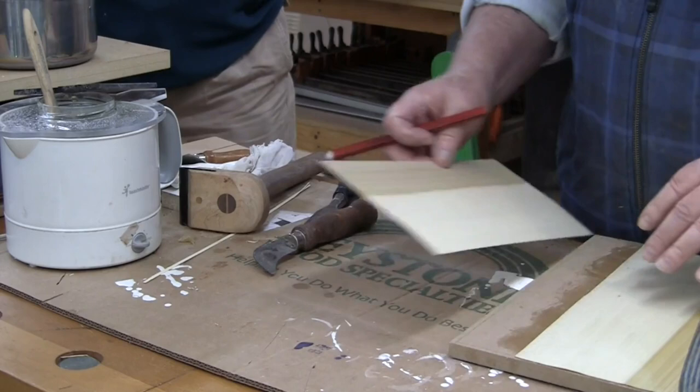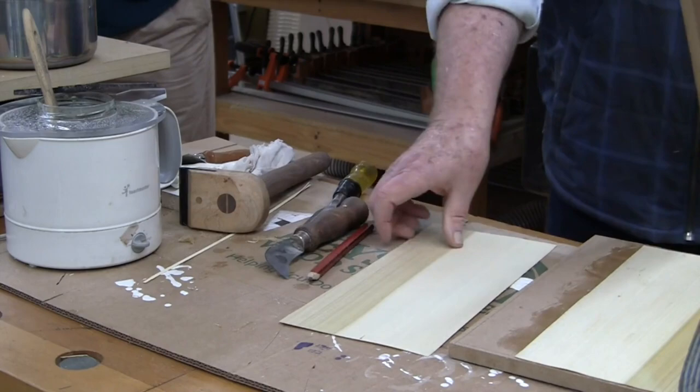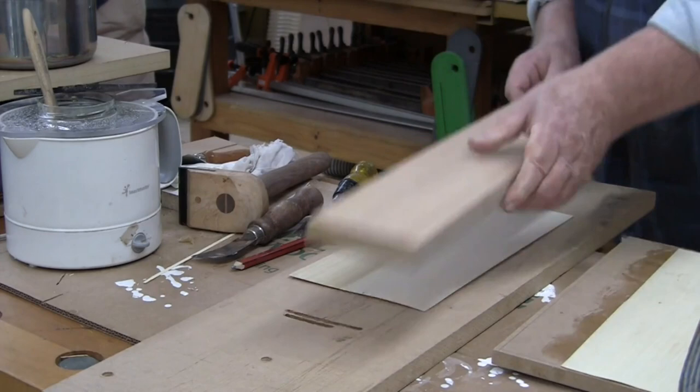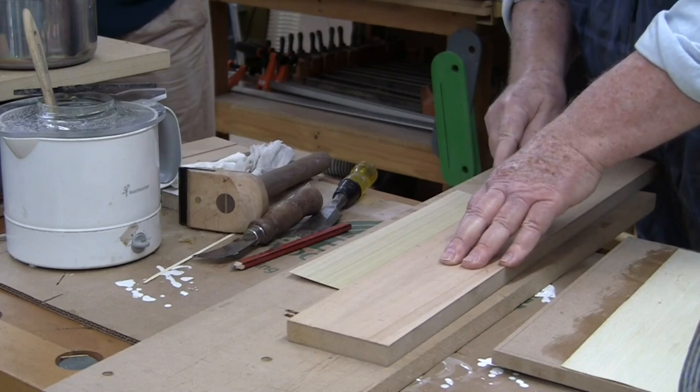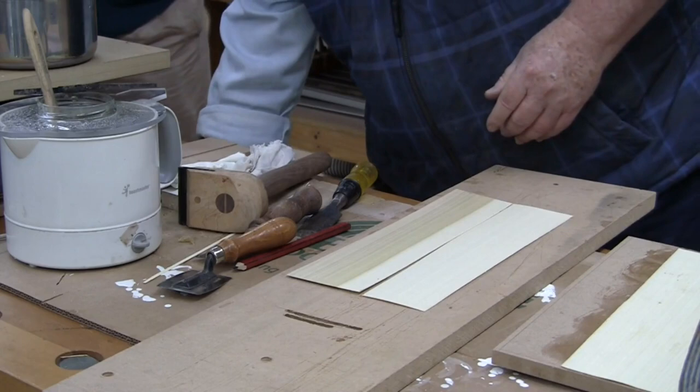How hard are you pushing with a hammer? Really hard down, like as hard as you can? No, good force. So if you don't see glue squeezing out from underneath the veneer, it's not enough, or the glue gelled. If that glue gelled and you let it sit, the next day you're going to see bubbles. If you squeeze way, way too hard or you don't get glue everywhere, the next day you're going to have a void. And we'll talk about how you deal with those.